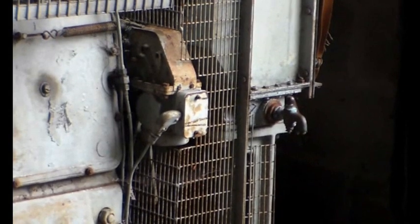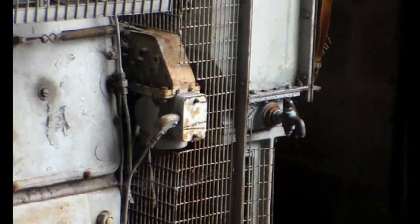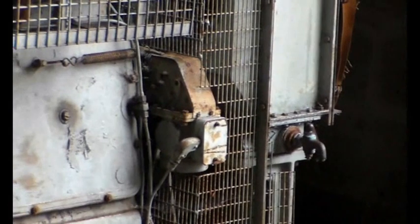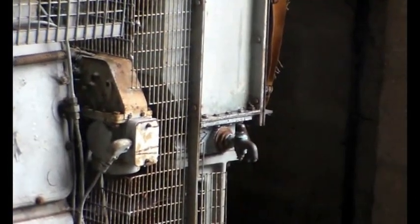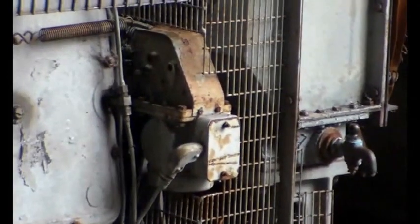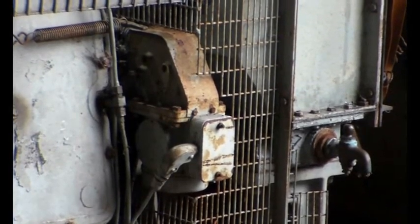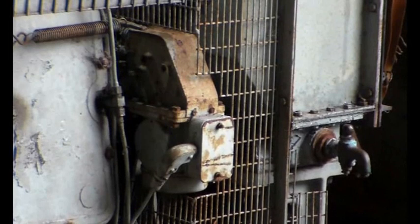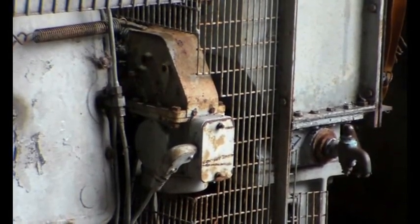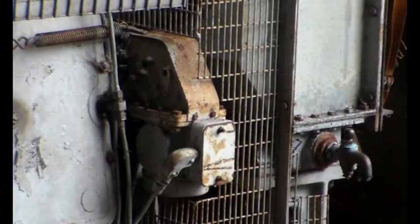You should be putting DC into that — I think 24 volts — and that is part of the governor. Now we've freed off the governor shaft, it actually needs 24 volts to go into that solenoid there to make sure that the pump is open enough to get full revs. At the moment I had to put my hand in there and pull that control rod, but now we've freed it off it's wanting to go back to tick over or even stop.